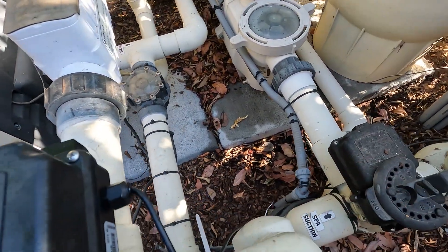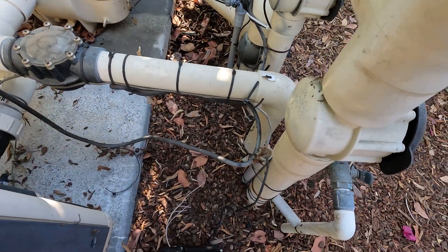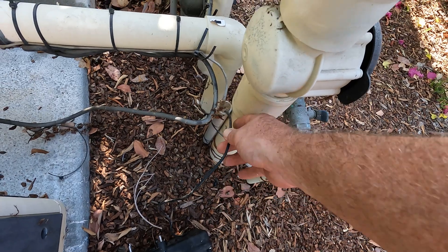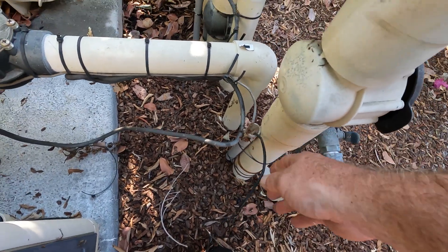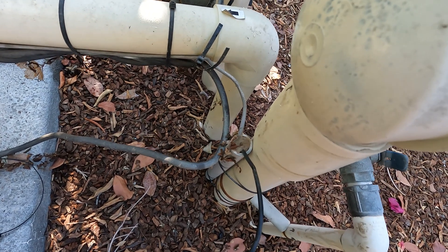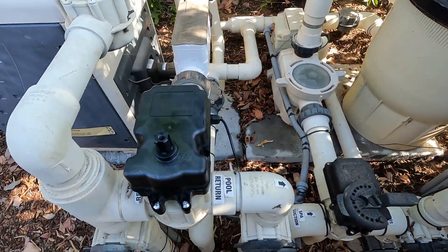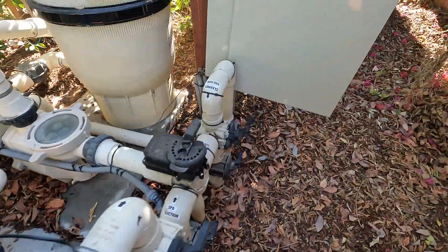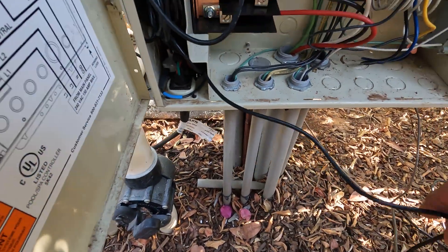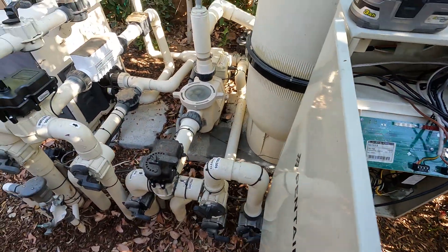Here's something for you builders — an actuator is obviously going to be replaced, as this is evidence of. When you're putting in your conduit and then seal it forever, that's a super bummer. It's nice to keep it watertight on the initial installation, but here we are five years down the road replacing an actuator. I've installed the actuator into the return side — there it is — and now we're going to button it up and they're using the spa again tonight.